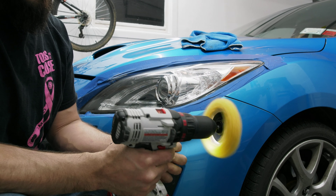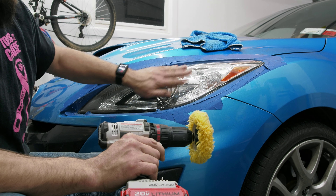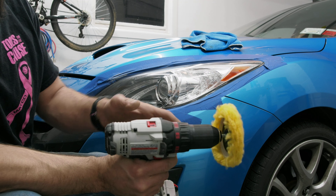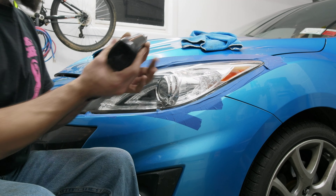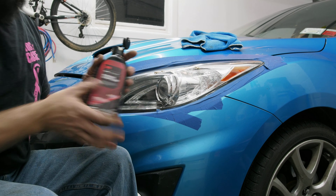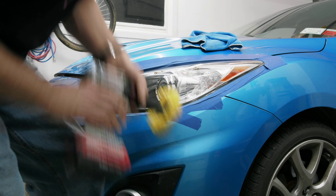You got your buffer. A little, very little speed on the drill. Make sure you don't burn it because you can actually melt these edges. If you go too fast, if you want to go slower, get a drill that has a slow speed on it. Grab your buffing compound — you don't need a lot. Just dab it on there, a little bit at a time. Don't overdo it; you'll get a bigger mess and you won't be able to see what you're doing.